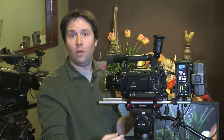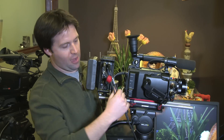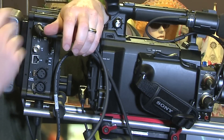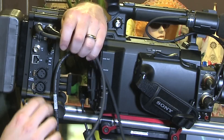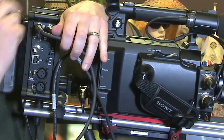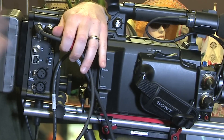There's also a simple playback control for playing back footage — very intuitive, I like that a lot. Coming around to the back of the unit, I have my feeds going in and out. The top two plugs are SDI inputs where I have SDI coming in from my camera, and it loops back out to a monitor — live and very easy to use. I additionally have HDMI in and HDMI out. The nice thing is I can send SDI in and get HDMI out, or vice versa, so it does convert live as well.